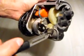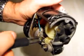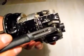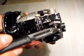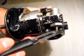So what else have we got? We've got a capacitor here. That is so that we don't get arcing across the points. And we have a connection there - that's for the P-lead. That's for the connection to the magneto switch. That's how we ground the magneto and make it inactive so that it will not fire.